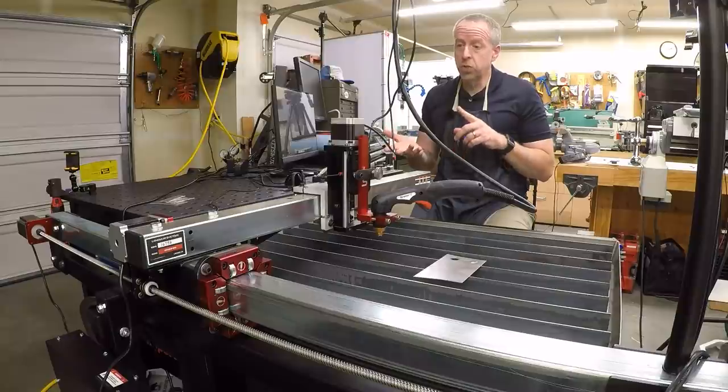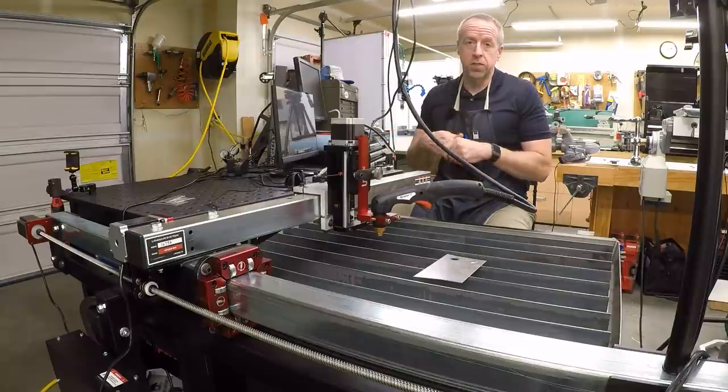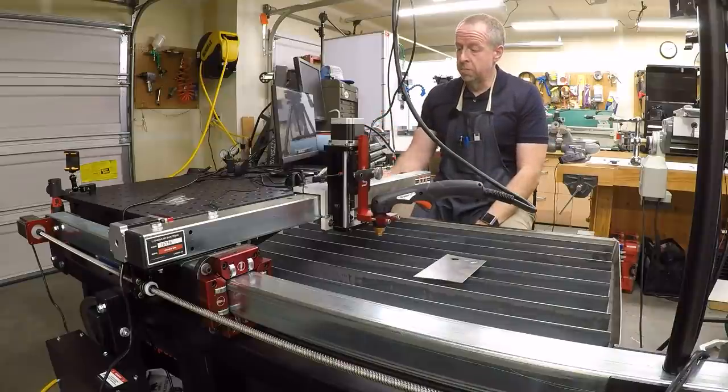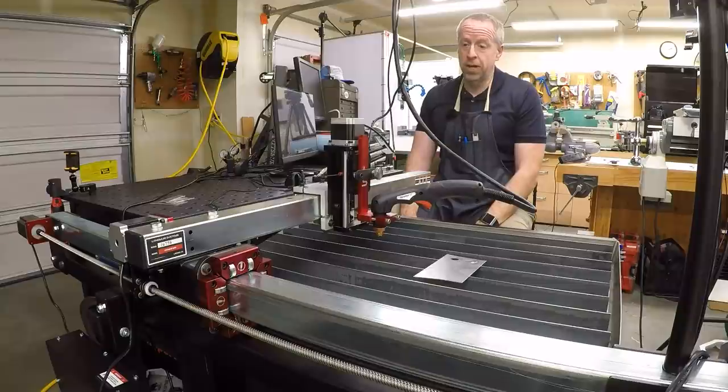More warnings: it's going to fire the torch — make sure it's in a safe place, it is. Hit the torch fire button, then hit a button once the arc is on. Be sure to wear proper eye protection, which I have right here. Live test result: 142.2 volts — similar to the 139 or so we measured with the voltmeter, so we're good. The plasma cutter is now wired up and connected into the CNC system: the software controls torch firing and reads back arc voltage for height control. I still need to fill the water table before cutting in earnest, and we'll do that in a future video.